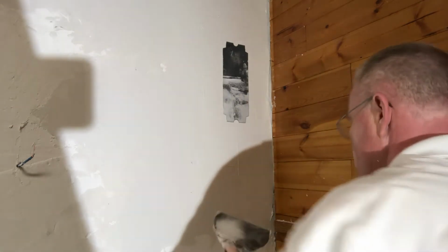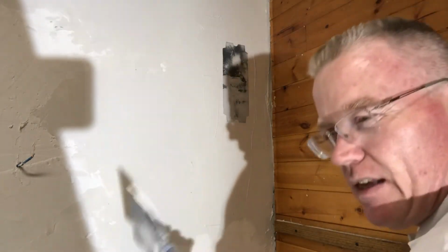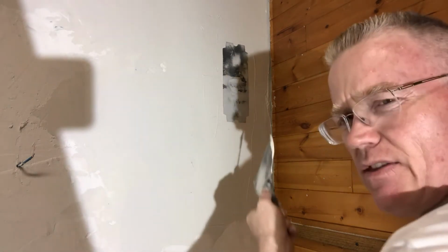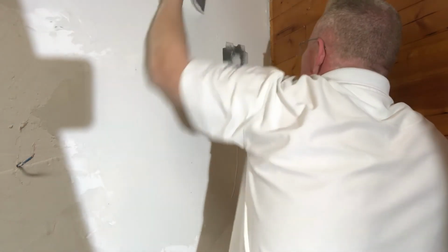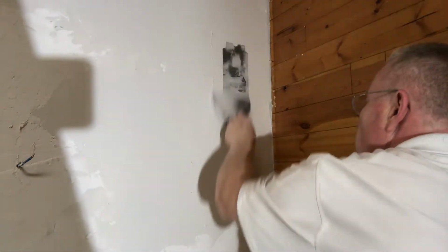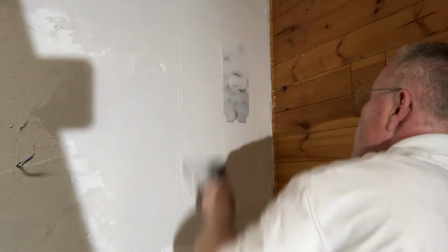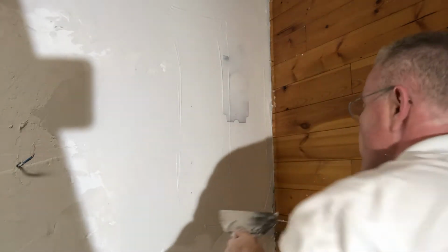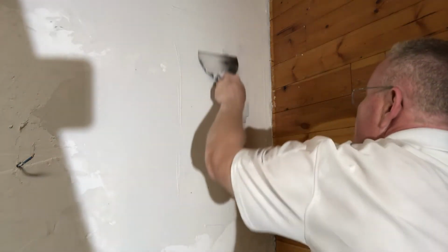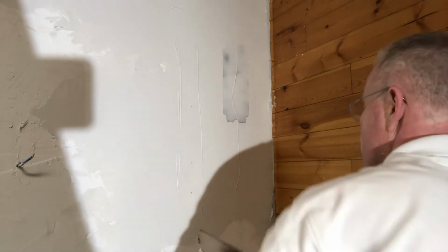Nobody taught me this. When you're working in the trade, you just realize that if the fiberglass mesh works, and because this screen has nooks and crannies in it, then this is actually stronger than the fiberglass mesh. It's common sense, but only when you're doing the trade. Now look at that repair. Look at how beautiful that is. This adds strength to that. Now, we have plaster sandwiched in between 2 screens.